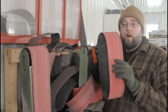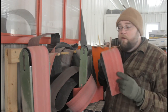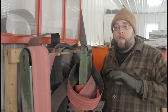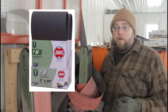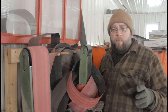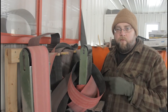Number four: do buy good quality ceramic belts. Over the past few years I've settled on using almost exclusively the Shredder belts from Combat Abrasives, but there are a number of good belts out there — get a real 3M Trisact belt, get something with a good quality ceramic grit. Do not go to Lowe's, Home Depot, Menards, or Harbor Freight and buy their off-the-shelf belts — they're all junk. The best belt you can buy over the counter is the Shopsmith belt; at least it's a real ceramic, but they don't come in a wide range of grits and they're expensive compared to buying online. In general, all big box store sanding belts suck — buy a real belt from a better supplier online.